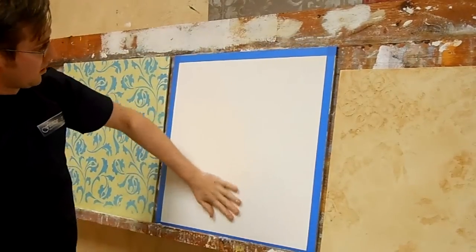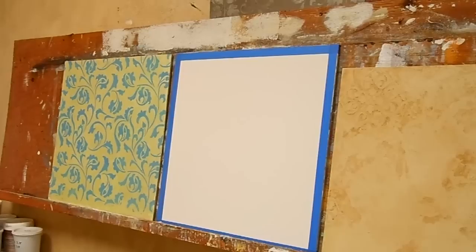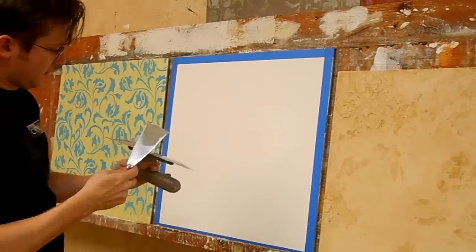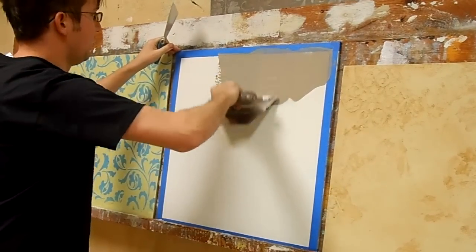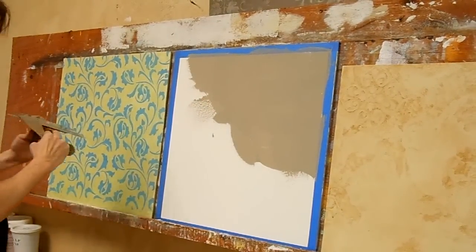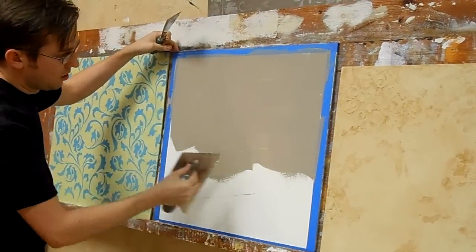And next we take our smooth board that I have already ready here. And on top of that, we're going to put our color of fine Marmorino. We're going to apply this pretty much the same way, except nice and tight over the whole board. Always covering our tracks. And you should be able to see a little bit of that white popping through.